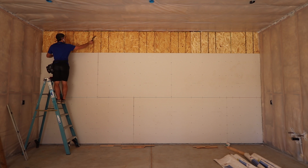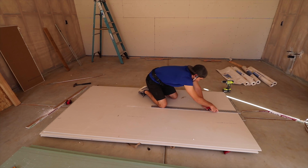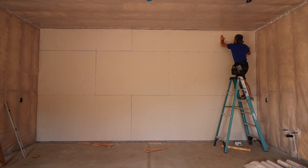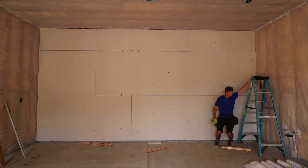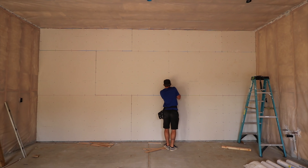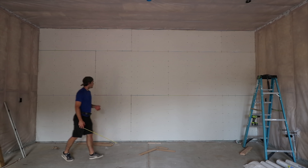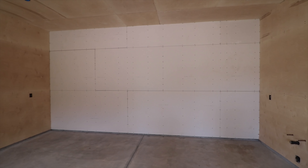Time for the top row. I double-checked to make sure no nails were sticking out, then measured the size of the sheet I needed. I marked it up and cut the sheet hot-dog style — pretty much exactly in half — so one sheet covered most of the top row. All I needed was one small piece to fill the top right corner, for which I used a leftover scrap from hanging drywall in the guest house. After all the sheets were hung I went through and added screws anywhere I missed and anywhere screws were more than 12 inches apart vertically. I counted all the screws used — if you want to guess the number, leave a comment.